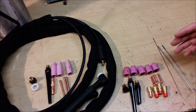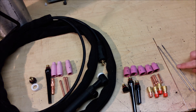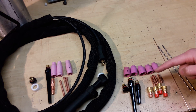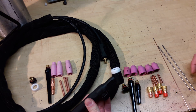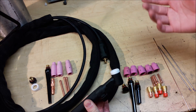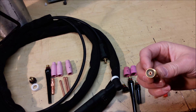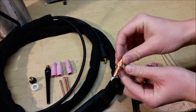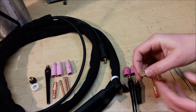To start TIG welding with the multi-process welder, you're going to need three more things: a bottle of argon, some tungsten, and filler rod. I'd also suggest getting a little accessory kit like this. I'm going to set it up now with the stubby kit — they call it stubby because everything's slightly shorter and smaller than what you get. This collet body is supposedly a little better because it's got a mesh outlet for the gas, whereas the standard ones just have holes, so the mesh disperses the gas more evenly.